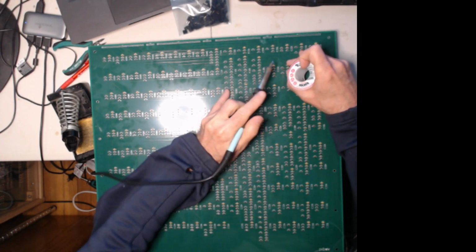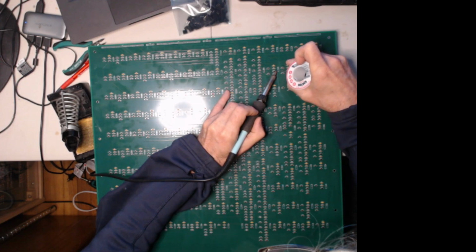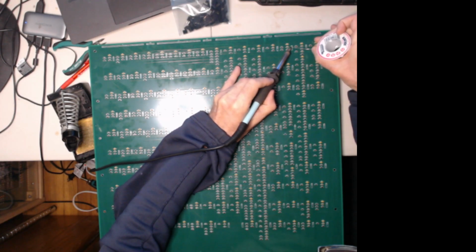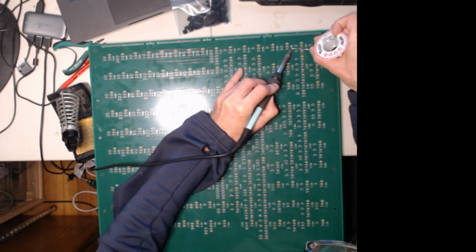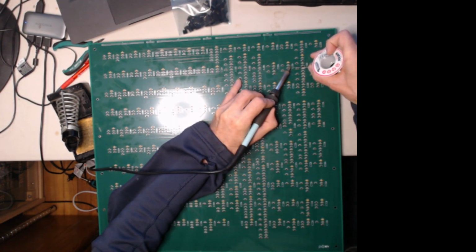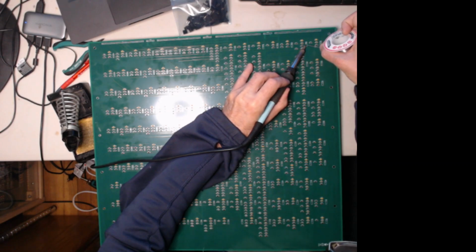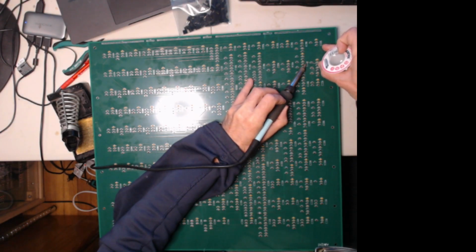Oh yeah, I have a backward diode. I put one backward diode in when I did the first one, and everything worked except the increment accumulator instruction. It did not increment the accumulator, it just kept it the same. I can't remember where the diode was exactly. It probably was on the ALU board somewhere. Out of everything, it's just the increment accumulator instruction didn't work. Could have just left it that way and programmed around it, but that would be silly. I can't remember how long, it probably took me an hour to track it down, though. But yeah, I used the test paddles and I found it.